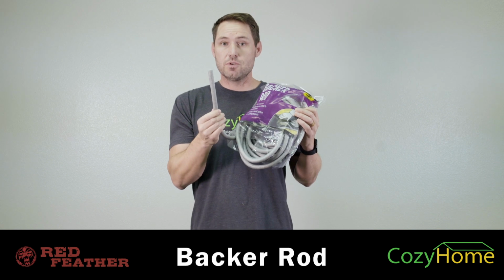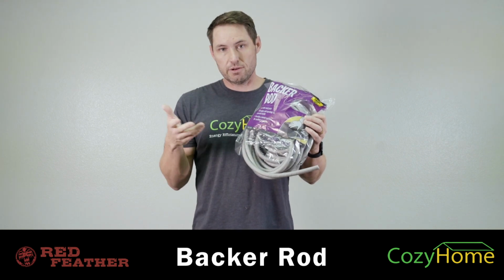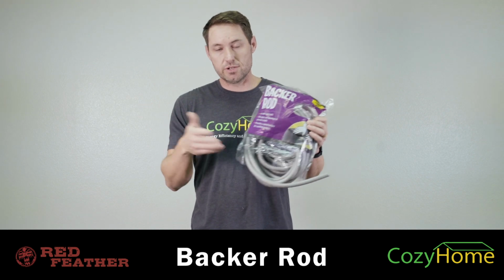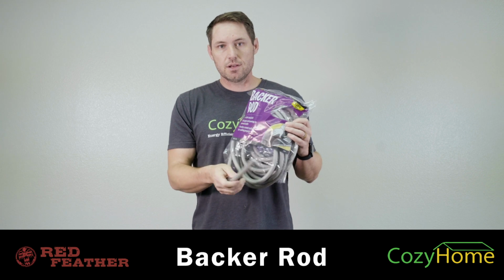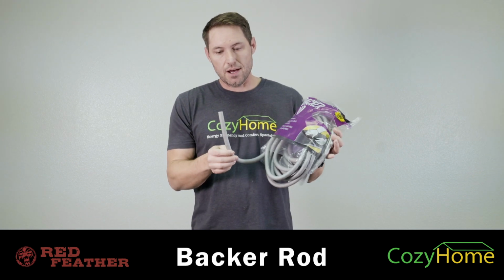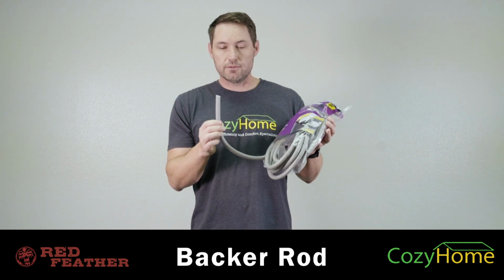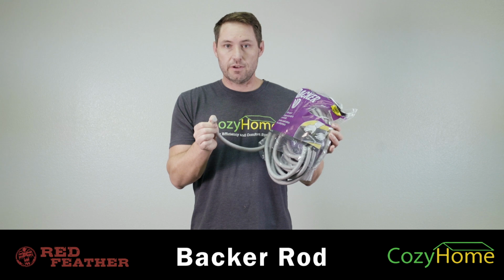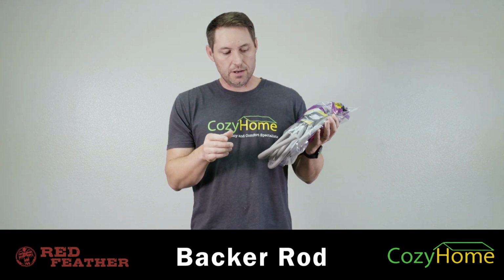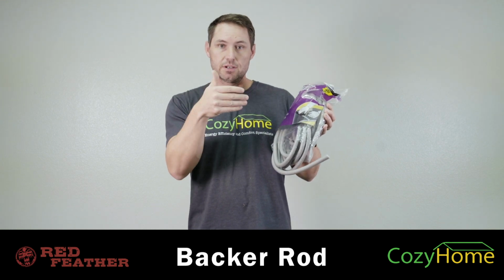What I like about this is it's removable, so instead of using spray foam, which you can't really remove, this can be removed after, during the winter you're using it to seal the gap, and then maybe you want to take it out after that. That's fine with this. It's real easy to pull out. It comes in a big long roll, and you can actually buy it in different diameters as well. So if you have a smaller gap or a bigger gap, you can buy it in different diameters. But the reason why it works really well with caulking is it gives the caulking something to push against.